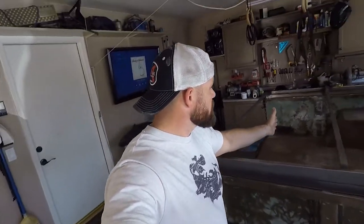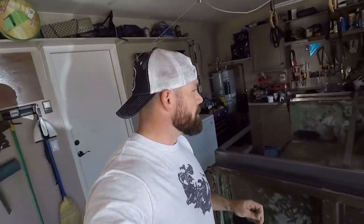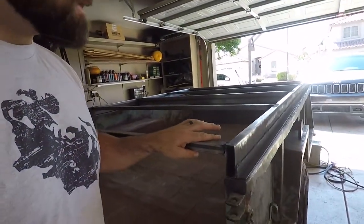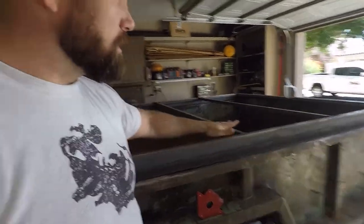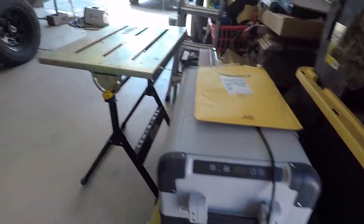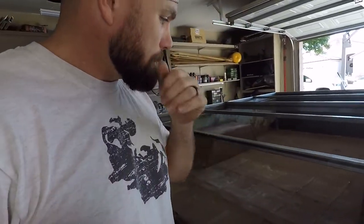I'm gonna square this up a little further, or I guess that's not the right word, but add some tubing here to the intermediate portions. I'm not sure if I explained it before, but why I had done the 1x here and the 3x here was just for structural stability. I needed a 1x for clearance. I'm going to be putting in a stove oven and a Dometic fridge, as you can see over here, and they're going to be on drawer slides. So in here, they just barely clear with the drawer slide height and this elevation here.